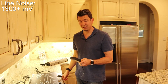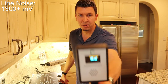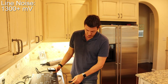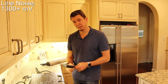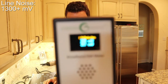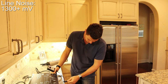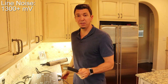This unit is providing a substantial reduction in the digital filter bank — the current reading is 268 millivolts. The next bank is the video filter, labeled for TV, monitor, or VCR. This isolated video filter is also doing some good reduction, reading 319 millivolts — so we're talking almost a 1000 millivolt reduction there. The next bank is an isolated analog audio filter for things like a receiver or processor, giving a pretty good reduction of 333 millivolts.